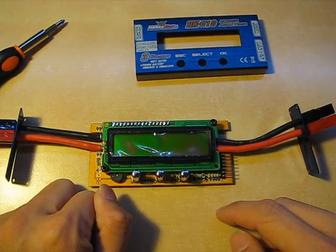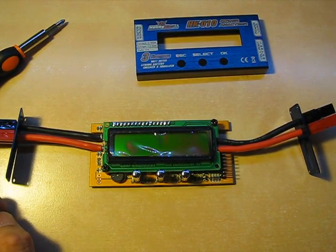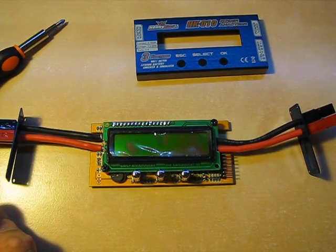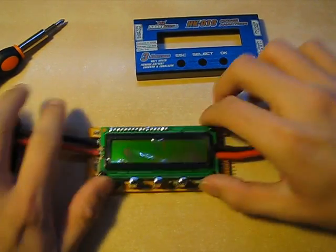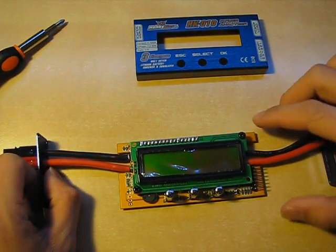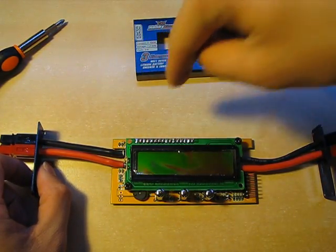The current sense network is more interesting, and I do have a nitpick. The current sense resistor is a slab of copper metal. Initially I thought it was just a piece of copper from a junk bin, but it's actually a precision-trimmed current sense resistor with a machined notch so it fits over onboard traces without heating them up under load. It should have fairly consistent resistance so all their models have similar calibration. The problem with the design is that the resistor sits between the two negative leads — your power source on one side, your current load on the other. Current sense works by running current through a very low resistance object and measuring the tiny voltage across it, which is proportional to current.